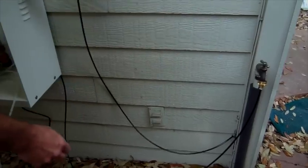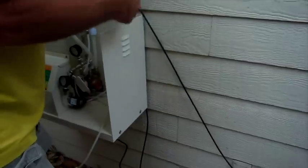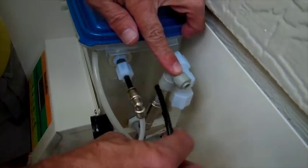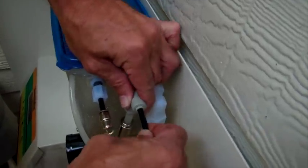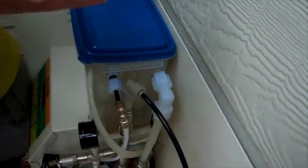This is going to be already connected to my nozzle circuit. I've left plenty of tube to reach, up the back of the equipment through the same slot. This elbow fitting right on top is a reducing elbow — it's three-eighths on this side, coming out of a check valve, and then it reduces to a quarter inch. Same setup: you just push it right in, just like you would your nozzles or your tubing in the field, and you're connected.